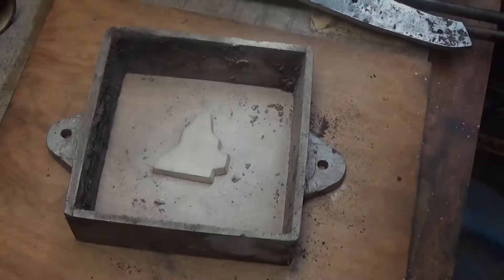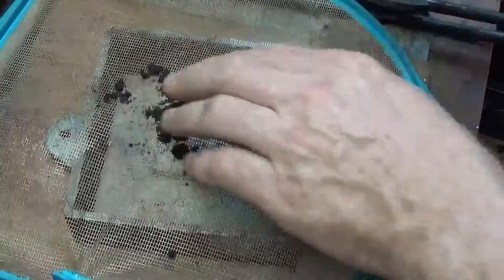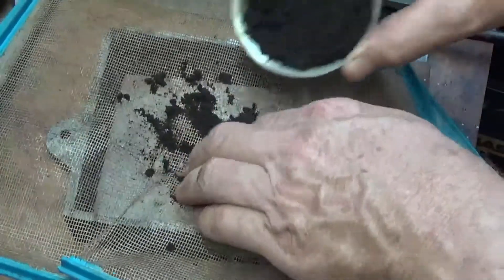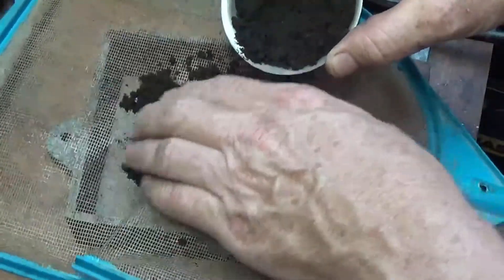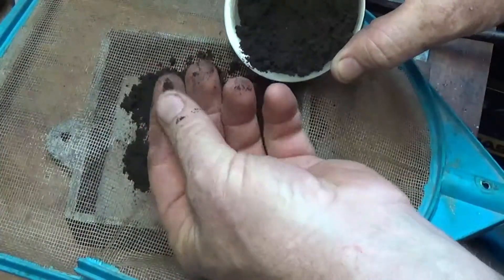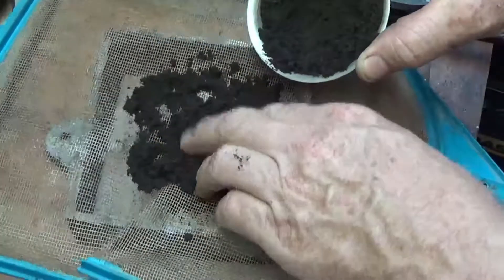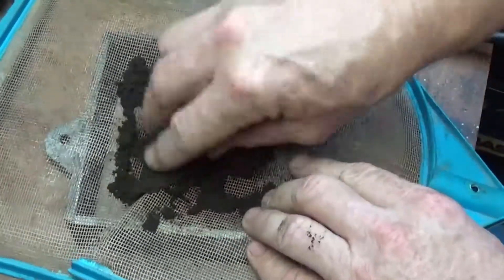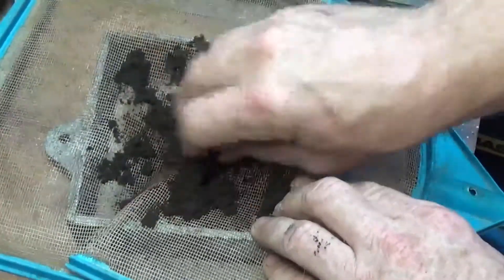I'll start putting the sand in. Here's the sand — this is a special mix: very fine sand, clay, and oil. This is the stuff I use when I'm trying to do more detailed work. You can use regular play sand if you want. What I like to do is screen it. You can see a little chunk of something from my last pour in here — some metal, probably some brass. We don't want that on our part. So at least the first piece, I'm going to go ahead and sift just to get enough sand covering the part.